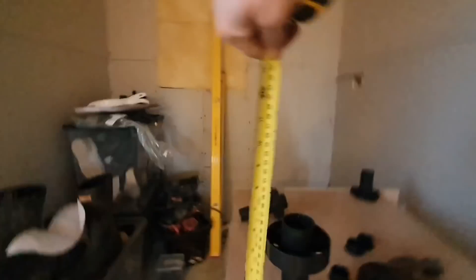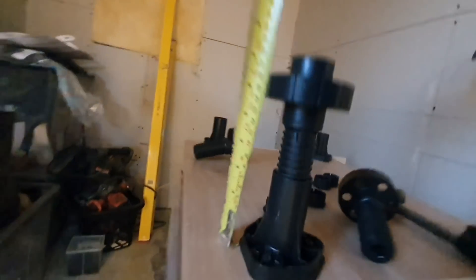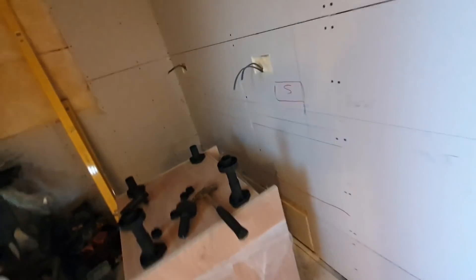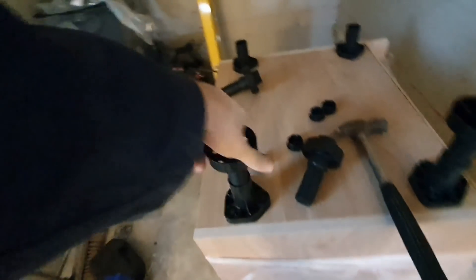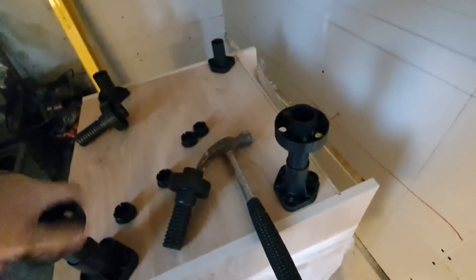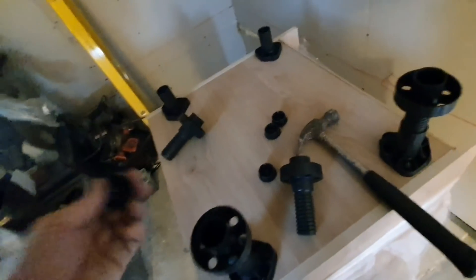My plinths are 170, so you measure up to that. It can be screwed down a little bit more, but if you get them down roughly to where you need them, that's just the job. I'll screw all these down to about 170, then level all through. Then all you do is stick your foot cap on the end.